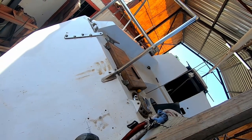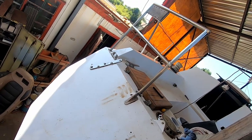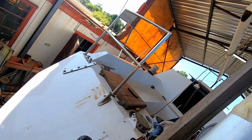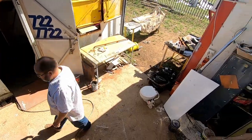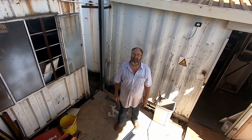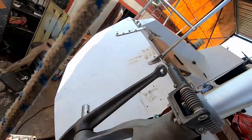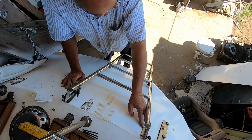So we've got to move that fitting over to the left-hand side, and cut a bit out of that stern rail so we can still climb on the boat — whether we fall over from drunkenness or swimming — while the wind vane is in the water. The ladder will also help us mount the wind vane since we can access it from the side. When we don't use the wind vane it'll be stored on deck and out of the way. Let's remove that quickly — that's going to be the new position of the ladder. We've marked the holes there so we'll drill them in.